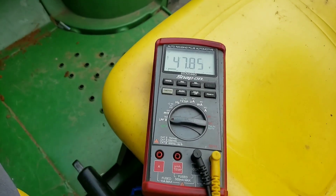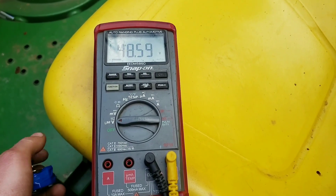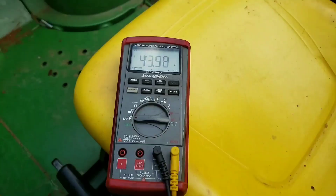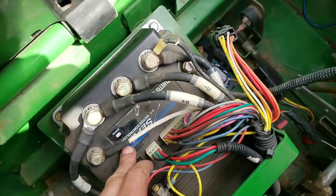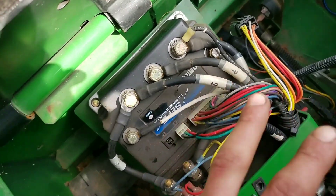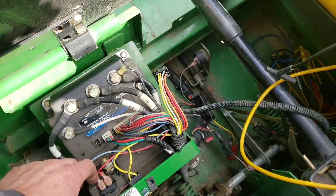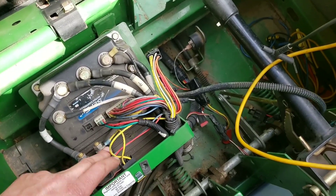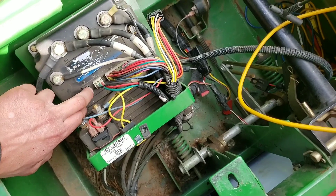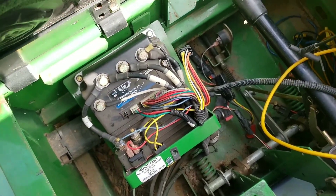Full amperage, full speed — until now we're going slow, we have a fault. If we do it one more time, cycle power — there we are. Simple as that. So we know we've got something making this module not happy. Now, known system operation: there's only two fault codes that are going to give us creep mode. Most of the faults on this will completely shut it down, won't let it move. We're going to pull inside here because this status light — you can't see it — but that's our blink code. Or if you've got the fancy $1,200 programmer controller that goes in J3, we can test it that way, which we will do in another video tomorrow just to show you two ways to do it.